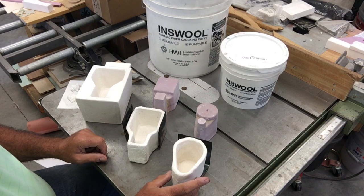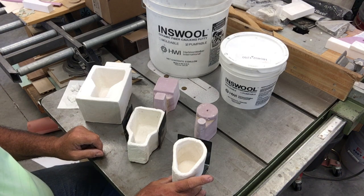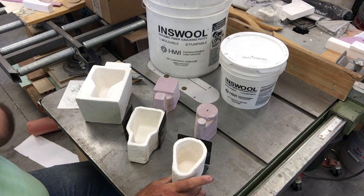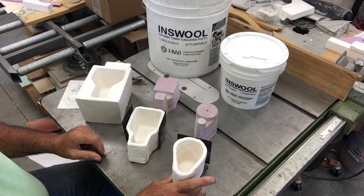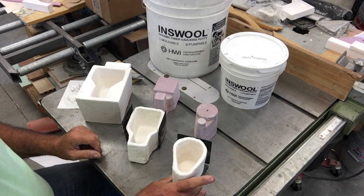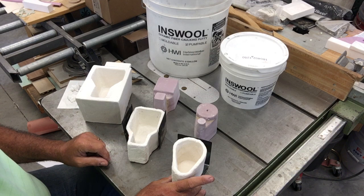It's a very high insulating material and very resistant to thermal shock. You can pour aluminum on it, take it out of a hot oven, and it's just not going to crack. It's very resilient in that respect, making it an excellent material for this reusable pouring cup — and I've got several sizes of them here.